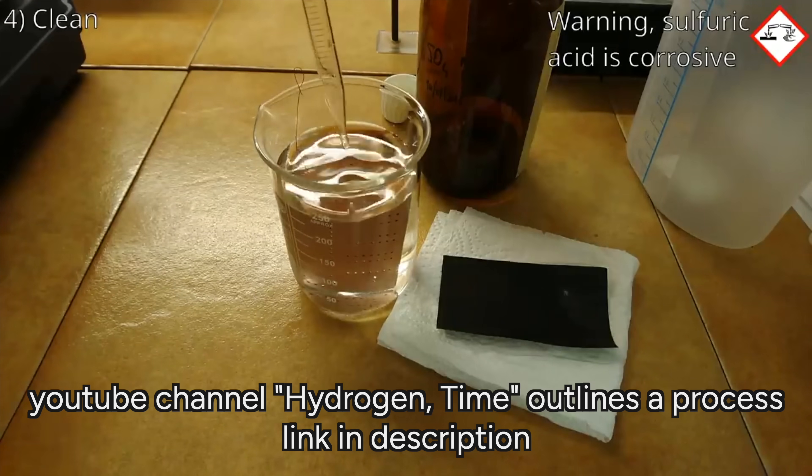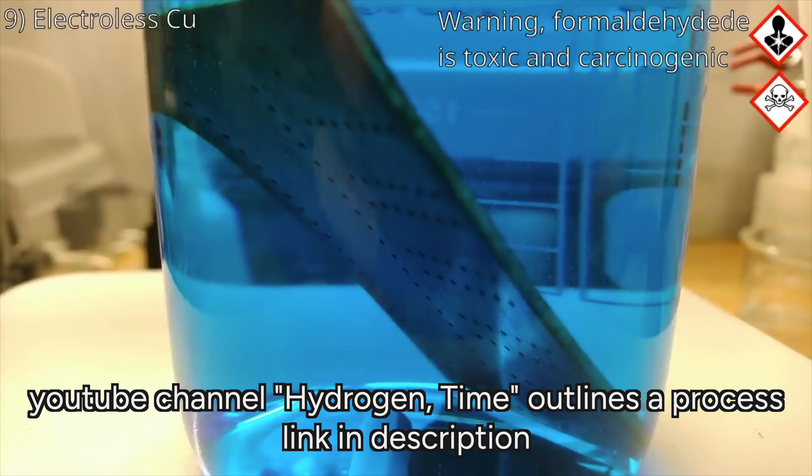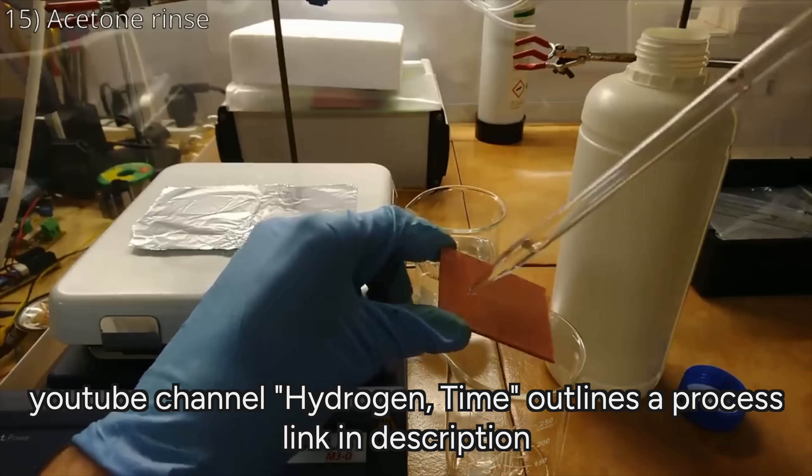The hole would be drilled with a laser and not with a drill bit, which should be okay. There are a lot of ways you can go about this, and it's actually very interesting. You effectively have to get something conductive in the holes, and then you charge the whole thing as a cathode, and then you can electroplate the entire board with copper and get a pretty good electrical connection through your vias.